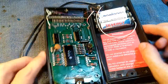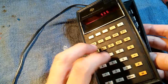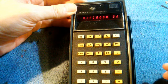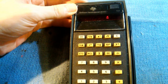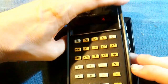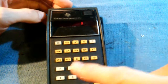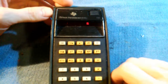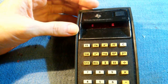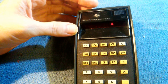We are connected to the charger and batteries and have normal operation. If we remove the batteries, this is what the calculator looks like running on the AC power supply with no batteries — the voltage is just spiking, turning on and off 60 times a second, causing all this craziness on the screen. If we can smooth out that voltage, we could run the calculator on the power supply without the batteries.